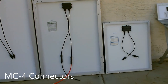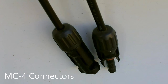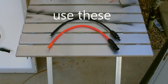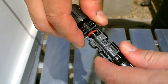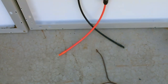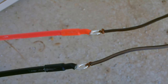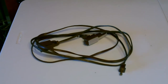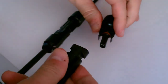Notice the connectors on the bigger ones — those are called MC4 style connections. Then you just twist the wire you want to use around those. For all of these I use indoor extension cord wire: cut off the plug and the outlet end and strip down the wire. By the way, these connectors come off pretty easily — you just push this in and pull it and it comes right out.